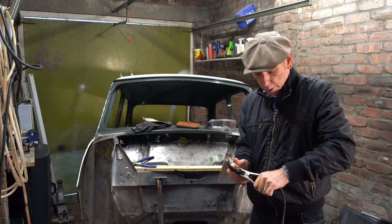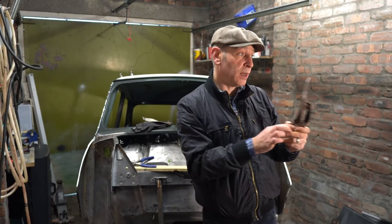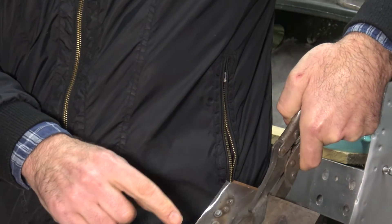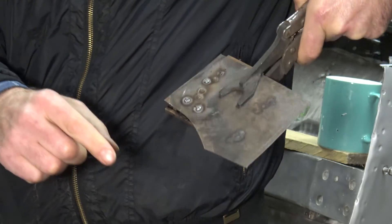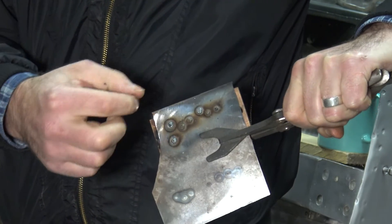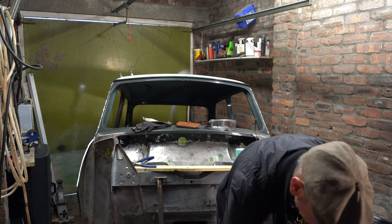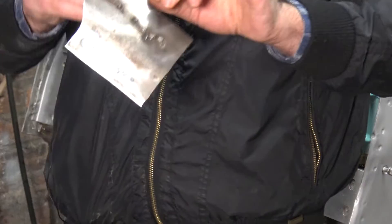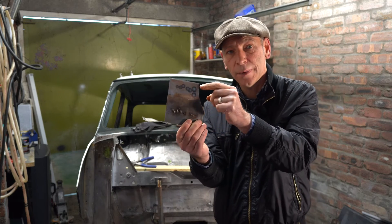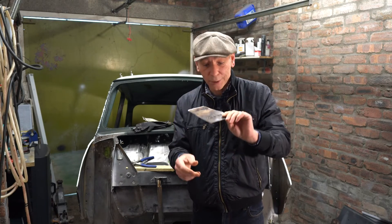Take this off a wee second — I'll show you the back. The copper backing is invaluable — these copper plates. You'll see from the last welds the heat penetration spreading. So, set this off — it's probably roasting hot. There you are. I don't know if you can see that, but the final ones there — you get good penetration. If you can get that far with welding, you're on to a winner, you're getting there.